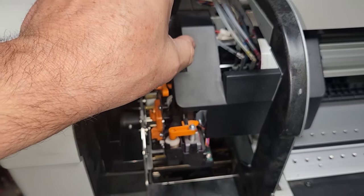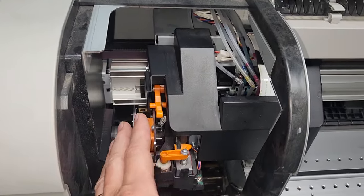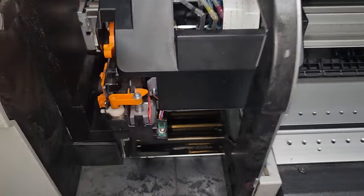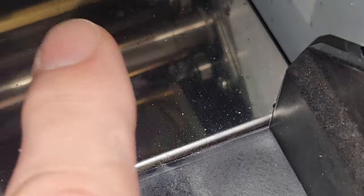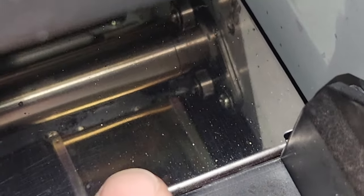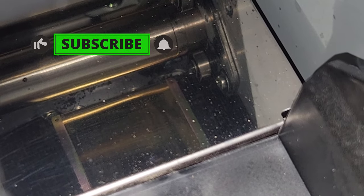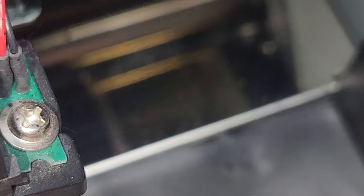Generally, there's a specific order. On this specific printer, the print head has to be down in order for the printer to shut off. But after a visual inspection, you can see down there, that's kind of that gold area right in there that's in the reflection. That is the actual bottom of the print head. You want to do a visual inspection, whether you bring a mirror, and look for scratches. If this printer was functional, then you would actually see ink droplets on the bottom. You would actually see ink droplets down in there.